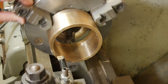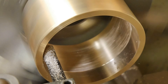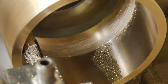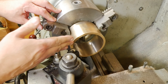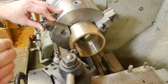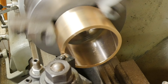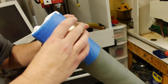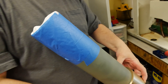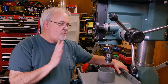So this bearing needs just a little bit more clearance. I've got it back here in the lathe - hopefully we're going to get it lined up and take a little bit more out of it. Just going to go in here and kiss this edge, chamfer it a little bit. That'll make it easier to slip over the shaft. Alright, let's go see how it fits. I think that's going to be a good fit.